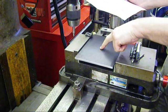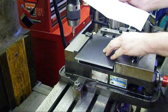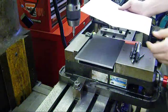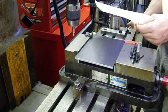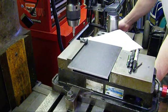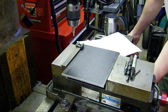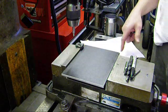What I'm going to do is come to the center first. The plate I cut is exactly eight inches wide — I milled each edge so it's square. So we're going to come over four inches and then come down 2.9925 inches, because the width is actually 5.9850 inches — it's not exactly six. So we're going over four inches on the X-axis, and then we're going to come down 2.9925 inches.